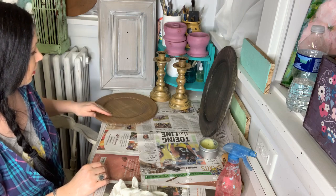I am going to paint it with smoky coal. Do I have to prime before I do it? So when I paint anything that's metal, if you are using not the milk paint, that's the stuff that will chip and flake and fall off over a piece of metal. Miss Petunia, she will throw a tantrum and fall off. But if you're using any of your favorite colors from our clay and mineral paint line that has the multiple resins included with it, it sticks to pretty much anything under the sun. So if I was going to paint a piece of metal, I would choose from that paint line.